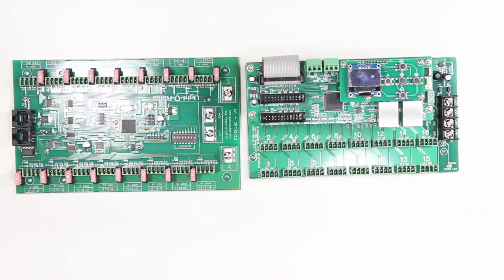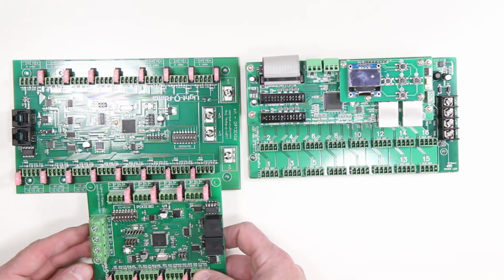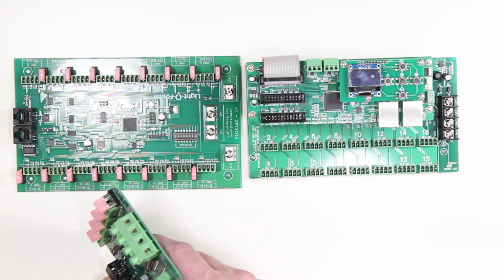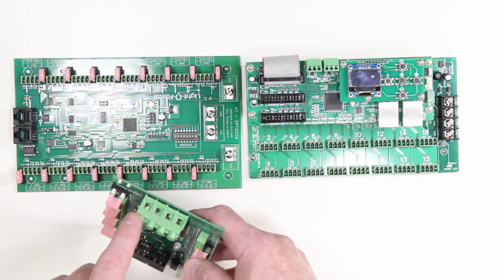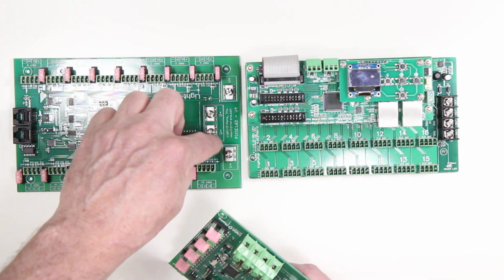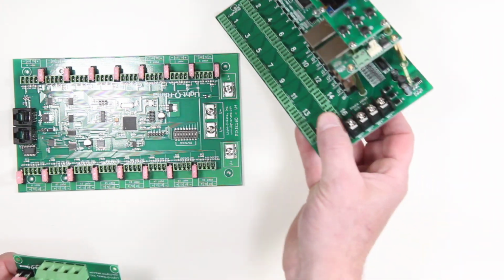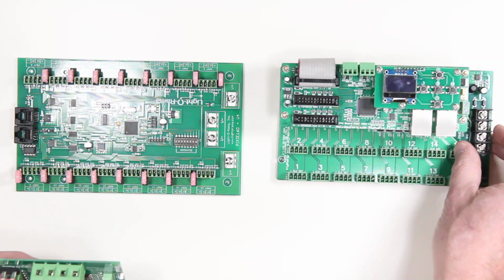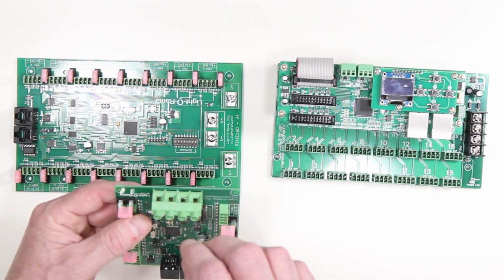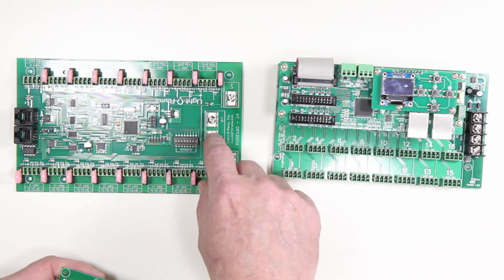And just for reference here is also the Pixie 8. This is the same kind of board. It's just 8 outputs. Now, there is a minor difference here. It does feature actually a better connector. So it would have been better if they probably actually had used this type of connector here than their connector here. So the ideal connector in these is this, then this. These sometimes have a problem with not crushing correctly the wire to get a good enough connection, and then finally this.